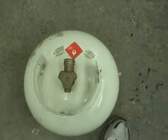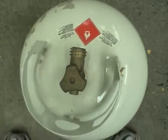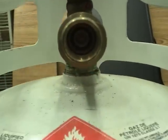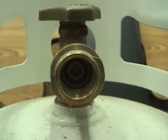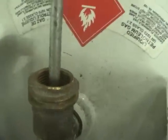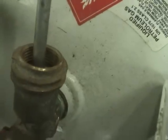The first thing you've got to do is make sure the tank is empty. Just because you open the valve and nothing comes out doesn't mean it's empty. In here, when you screw in the connection it pushes in a secondary valve to make sure you can't release gas just by opening the valve. So you have to stick something in and push a bit. In this case there doesn't seem to be anything in it, so I think we're good.